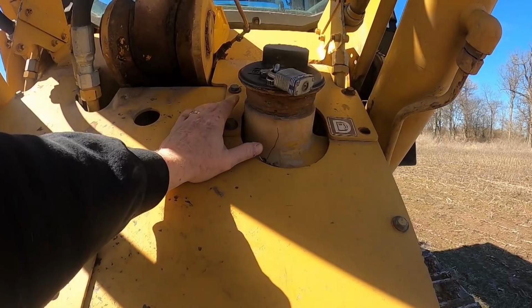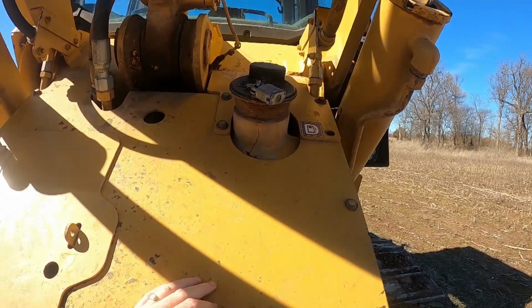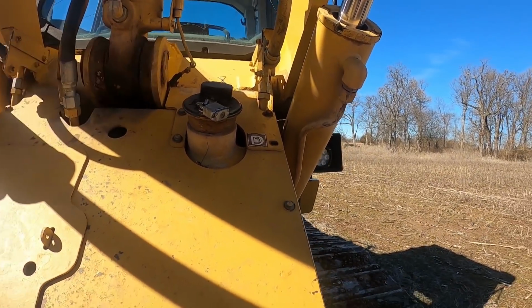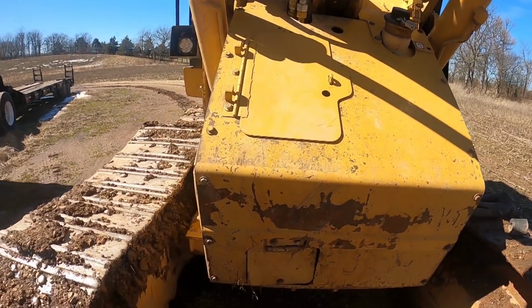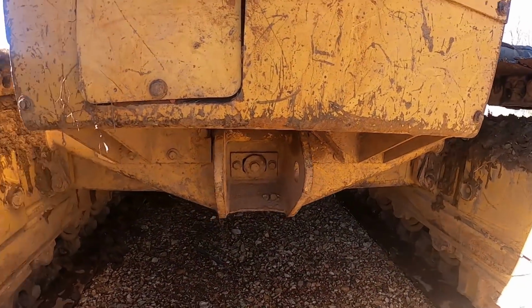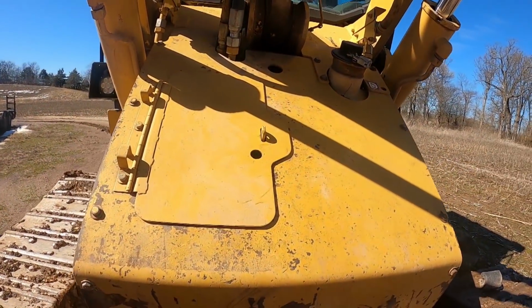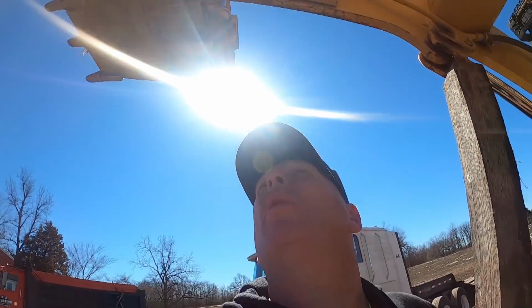I'm going to look at my fuel level sending unit inside the tank. I think I need a new one, because it's intermittent, it drops up and down. I'm going to look at the connection on it and clean it up, but I'm probably going to have to end up getting a new one. Also, there are some bolts underneath here that have to be taken out as well, so it's probably a good time to be cleaning anyway. So anyway, I'm going to fire the old Milwaukee up and see what I can come up with.